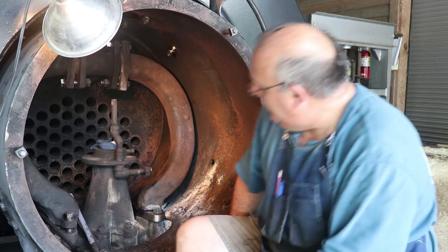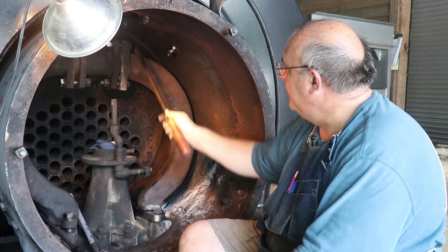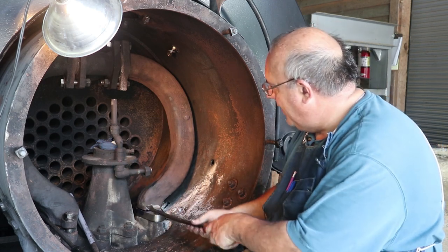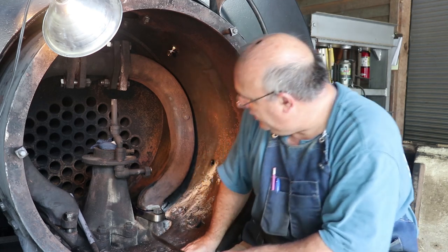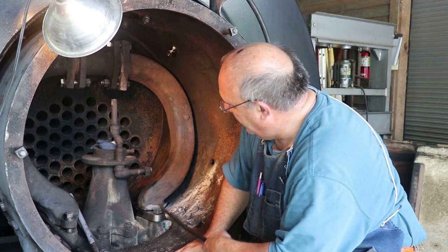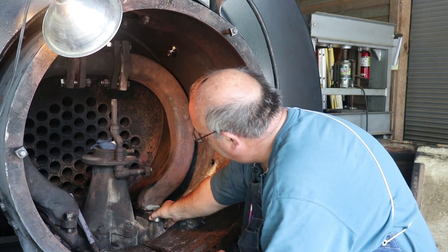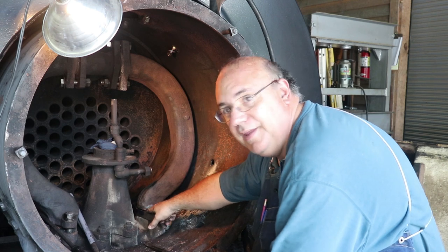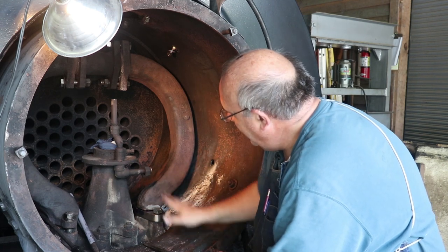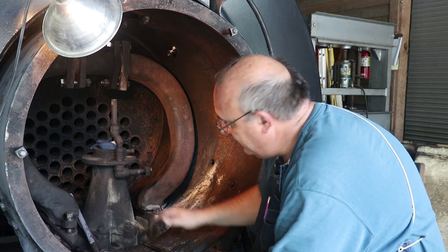So we came in and I mounted the steam pipe, mounted up on the top bolts, just like it's going to go when it's all said and done. Of course, my bottom flange was cut off, so I had plenty of room down here on the bottom. It was just free floating around. Right now I've got the flange sitting down here on the bottom, just so you can see. And you can see there's a little bit of gap here in the front. There's actually a bigger gap in the back. And I figured out that that cut was not flat compared to where it needs to be.